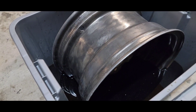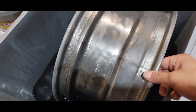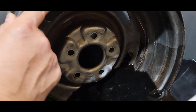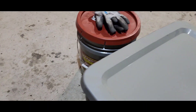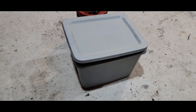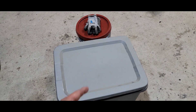This one is soaking now. Yesterday I worked on it for a couple hours and hit it as much as I could — this one was pitted real bad on both sides, so I got all that out. She's soaking now so it's going to remove whatever rust is in there. I got to go pick up some more five-gallon buckets — about a hundred bucks. I'm going to try to order another one in the morning so I can fill it up pretty high. It's reusable too — once I'm done soaking all my parts I'll pour it right back into the five-gallon buckets. It evaporates somehow — Evaporust evaporates in the air.